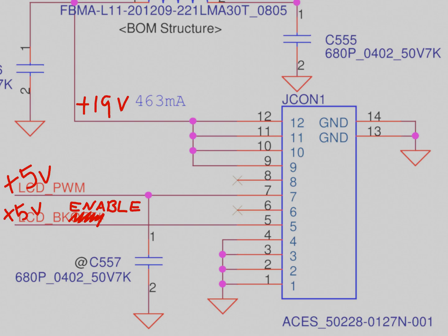I didn't want to put too high a voltage on pins 5 and 7 and fry anything, and since I want to always run this light as on and at full brightness, that means that there will always be true or 5 volts on pins 5 and 7.